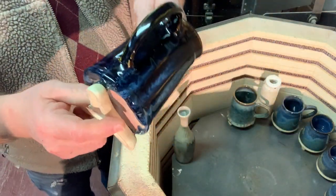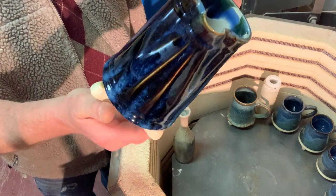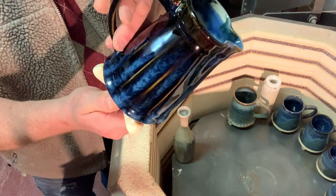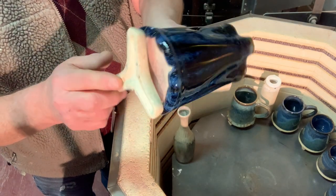I think I might try a faster cool — instead of 125 down, speed the cool up from 2225 down to about 2000, and then do a slow cool from 2000 to 1750, to see if that reduces the amount of running. But it's really nice the way it ran down and almost touched the kiln shelf. Here's another one of those black ones — this is the licorice with blue over it, and it really does that luminous blue look, but I'll have to grind that off a little bit.